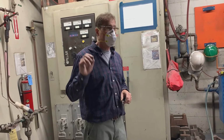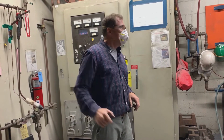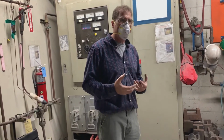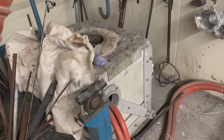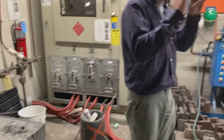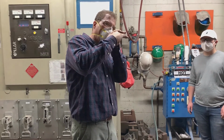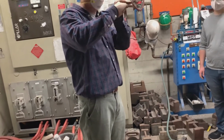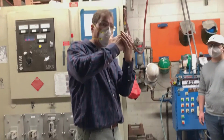If something happens, in that furnace you've got about 30 seconds to react. Because you'll start hearing a pounding noise, and that's steam building up in the coils. Eventually the fiberglass will start burning on the outside of the coils, and then the coils themselves can actually fail. Now, the bigger problem is if you have a spill internally. In other words, there's a crack in that furnace, the molten metal will start to fin and go into the refractory in the crack. Even if you put a plug on the surface of that, there's still molten metal. Every time you heat the furnace up, the induction is heating that liquid metal in there too, right?